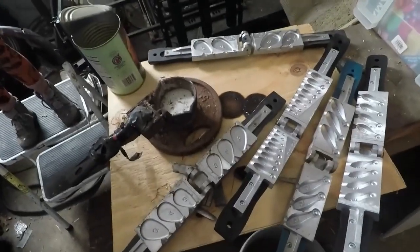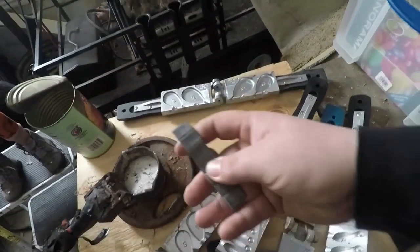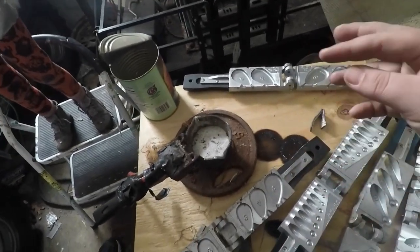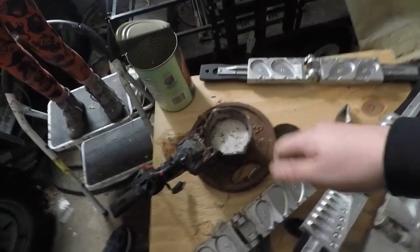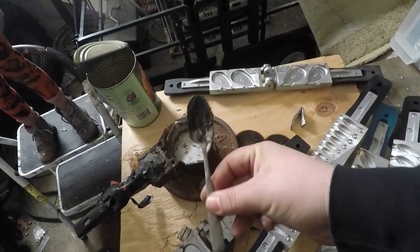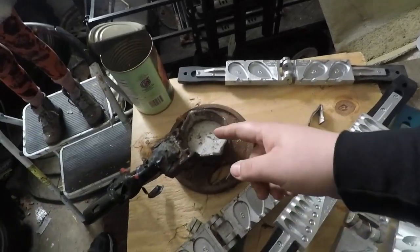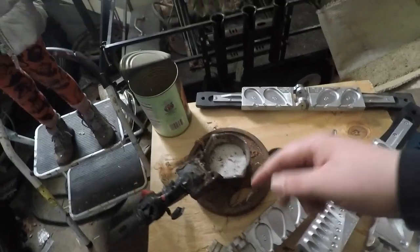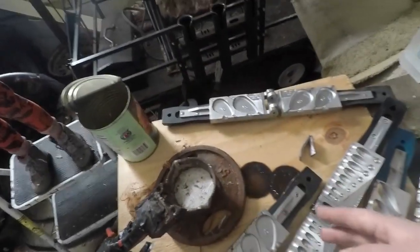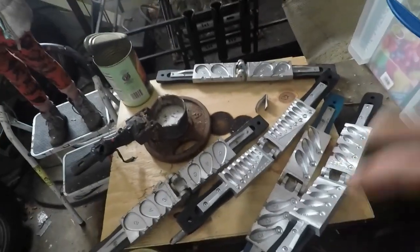Basically, all you have to do is you've got your smelting pot and your lead weight. We use tire lead — these are stick-on lead weights and we've also got a bunch of clip-ons. All you do is put your lead into your smelting pot, it gets nice and hot. We will take our scraper — which is nothing more than just a spoon here. Do not use your wife or mom's favorite spoon, they'll kill you. You take your scraper, scrape the top of the lead off. That's where all your trash will actually float up to. We've got our scrap bucket right here that we'll bang it off in. Then you pour it into your mold, wait for it to cool, open up your mold, and out pops your sinker. So enough said, let's just get to it so I can show you guys exactly how to do it.